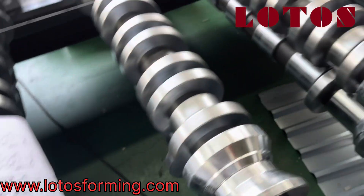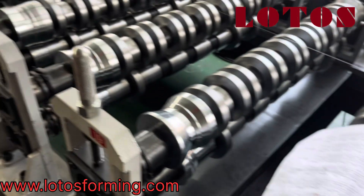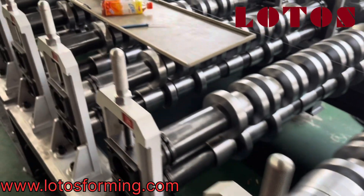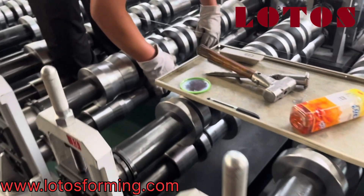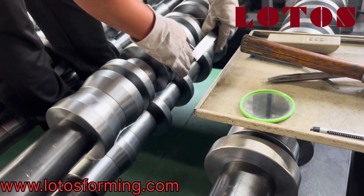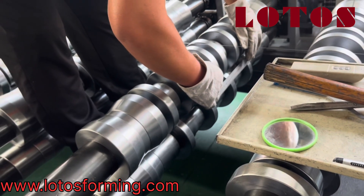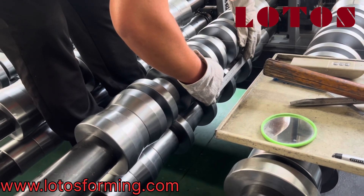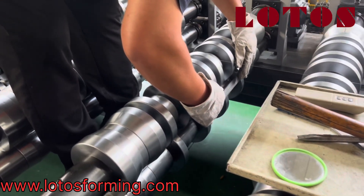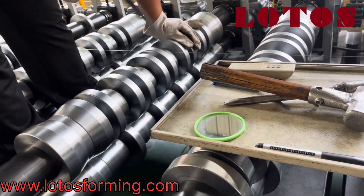So we put this line and we make sure it's in the center of the front first roller and last roller, to adjust the rollers based on this. This wire should be as thin as possible. I like this mirror — look at this mirror, you can see all the wire in the middle.